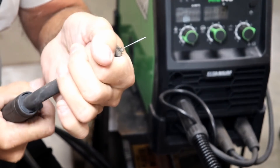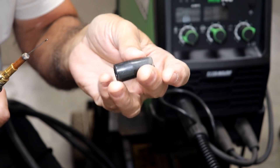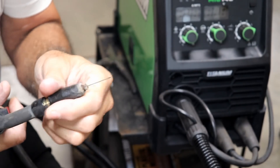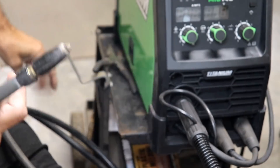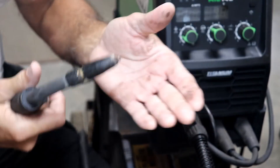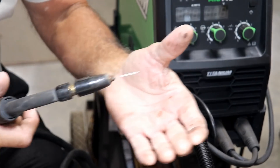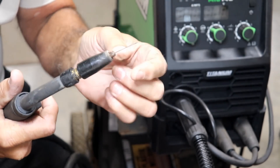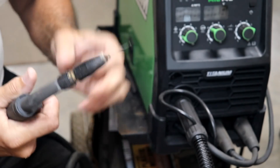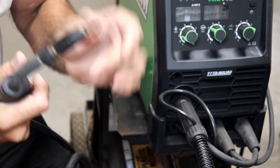The second thing you need to know is that you use a different tip. This is a ceramic tip. With flux core you don't want to use your metal tip — you want a ceramic tip. That also helps with spatter. Another helpful thing — they make an anti-spatter gel that comes in a tub or spray. You can dip the tip into the gel, which keeps spatter from sticking and also seems to lubricate the wire and keep it from sticking up. I've gone through quite a few tips, but a lot less once I got it set up correctly.